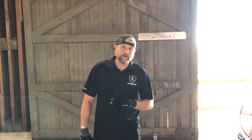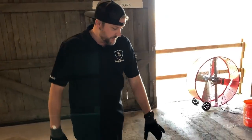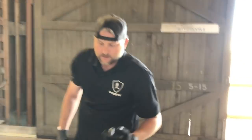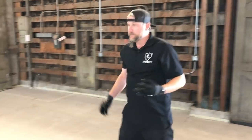Coolest overlays you can do. It's a wood grain texture, and you can just see how nasty this concrete is. It's all pitted out, cracked. We got like a trough here that something ran over for years and just kind of took away that area. So what we've done is taken our scratch coat and our texture coat, and we've mixed those two together